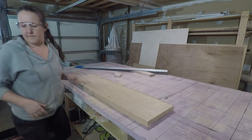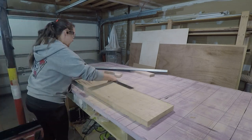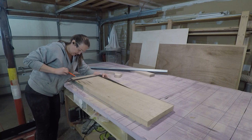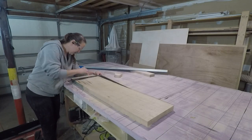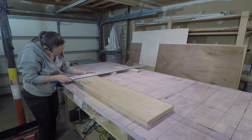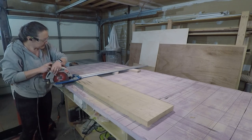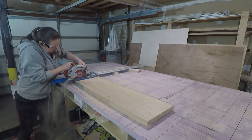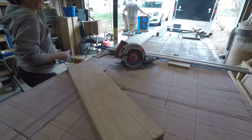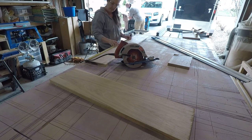I tried to take a few more precautions while putting together these benches. But it's really great because the actual construction and design of the benches is so simple that it allowed me to use a new wood, which was really fun to work with. To cut down the bench tops, I just relied on my circular saw on a piece of 2-inch rigid foam, and this allows the entire piece of board to be fully supported. With this extra hard wood — the hickory — it's not going to bend or pinch my blade as I'm cutting.